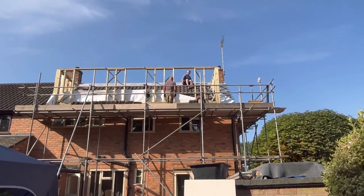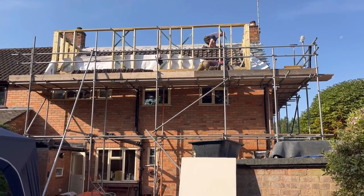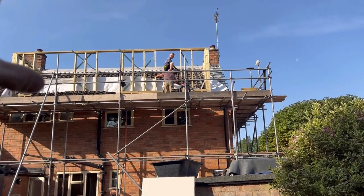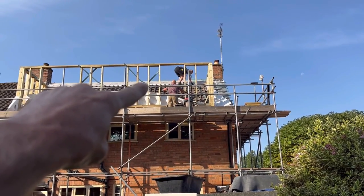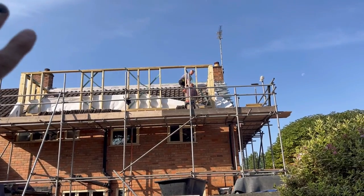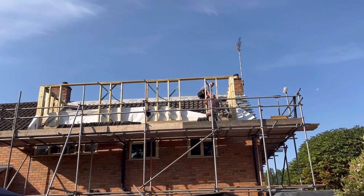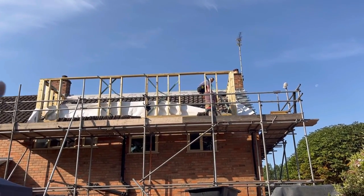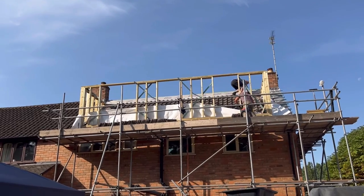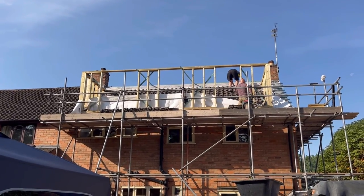As you would have seen, I was going to show you the transformation of the back of the house. All we're doing now is stripping off all of these tiles inside our framework, because the dormer framework — other than doing the windows, which is window, window, French doors — I've got a little bit of timber in there to make those, but the structure as it stands is in there. We're going to strip that, take out the collar ties from inside, take all the felt and all the tiles off, get in then and start setting out ready to put the steels up. Today and tomorrow we're going to try and get this to a point where we can waterproof it, ready for the storms on Wednesday potentially.